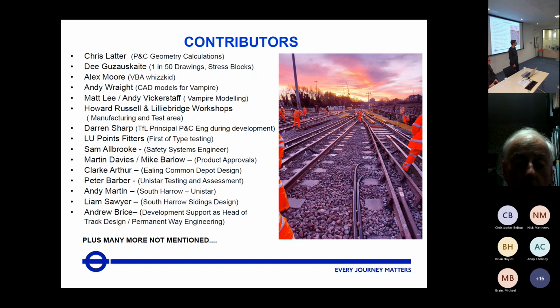Later slides, you mentioned you had a bullet point on there about neck planing. Yes. Is that something that the French used in the revolution? So we just widened it around the neck, to I think it was 51 millimetres around the neck on the crossing. Oh, right, okay. And what was that improving? Well, I think it was linked in with the general gauge widening that we put in. I'll be interested to see a drawing of that. Indeed, yes, it exists. But it was a one-off on those really tight switches on the West End. We've not done it anywhere else.